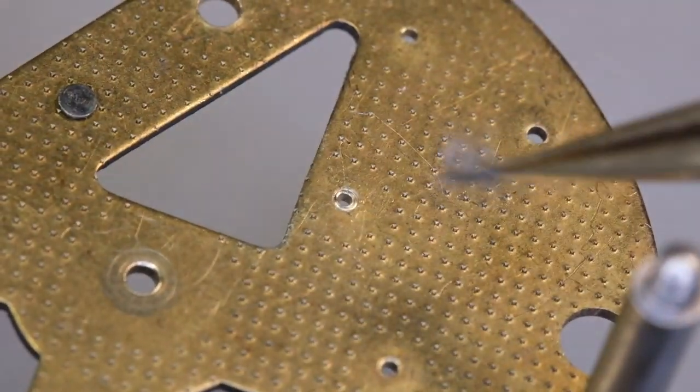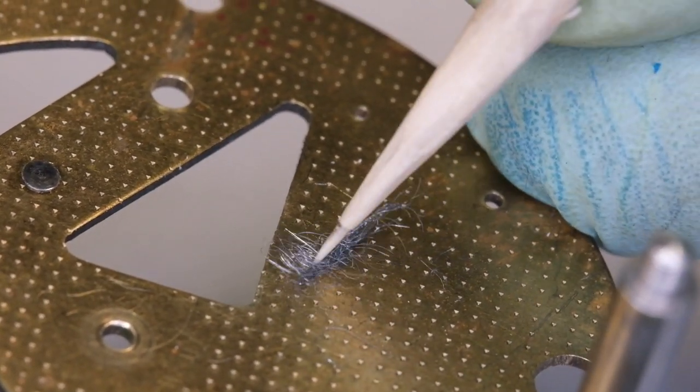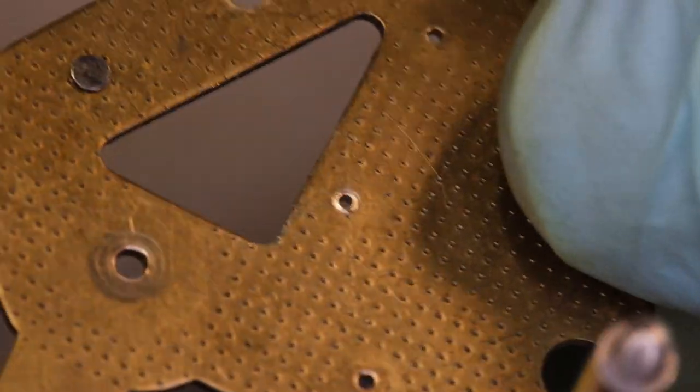Once I've done that, I deburr the inside in particular of the hole with 4/0 steel wool on a piece of pegwood, and then test that there is that absolutely necessary side and end shake again.